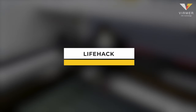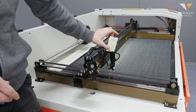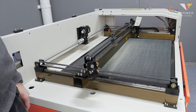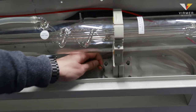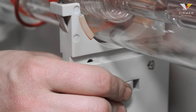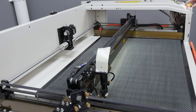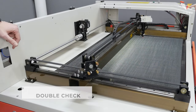And here is a life hack. If you are unable to adjust the third mirror, do not rush to readjust. It is enough to adjust the position of the laser tube. To do this, loosen the fastening and move the laser tube a little closer to the edge. Check the result with a short pulse. Remember to check the beam again on the other mirrors too, as we may have broken the optical path.